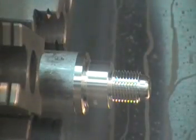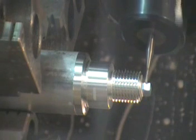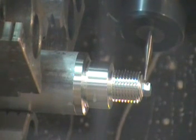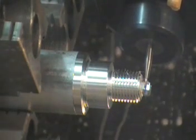The modified spark plug shown here was cut on an LT200 horizontal twin spindle lathe with milling capabilities. Total cycle time, excluding engraving, is 4 minutes and 36 seconds. This short cycle time is made possible because the machine began cutting parts immediately and the two spindles operate simultaneously, each cutting one end of the spark plug.